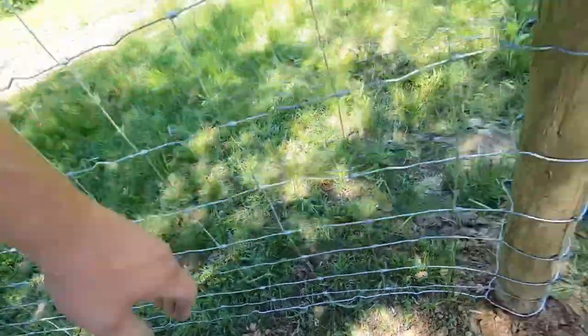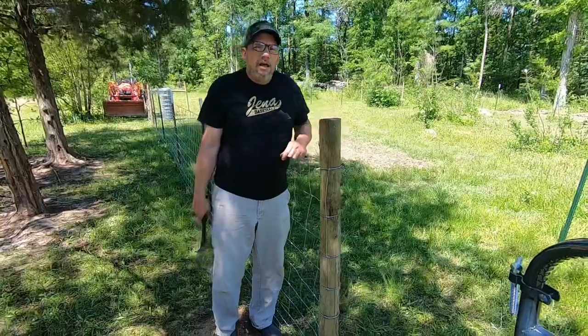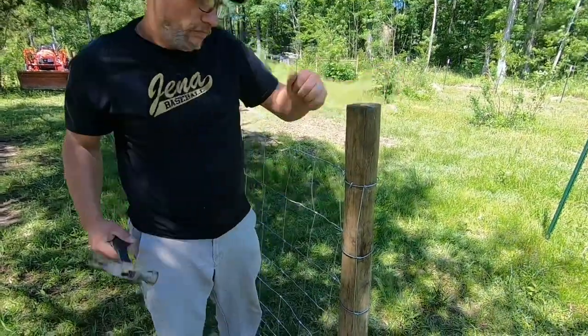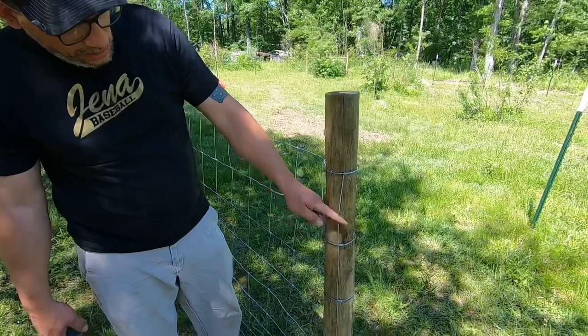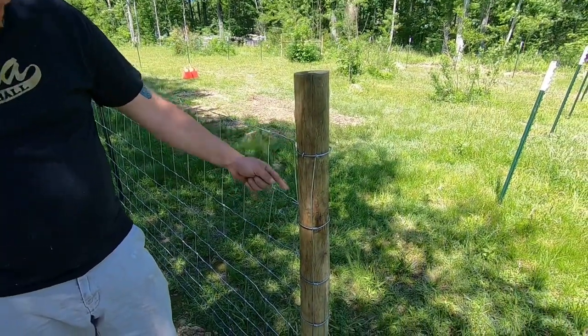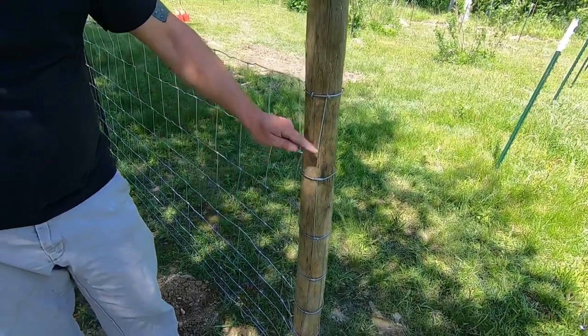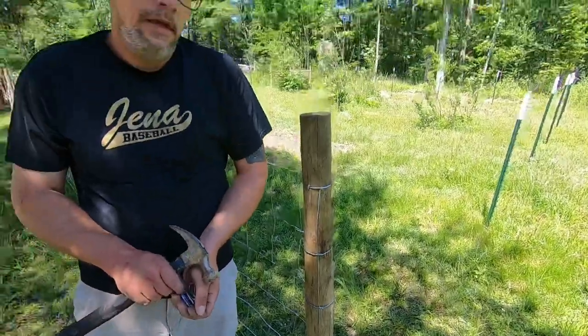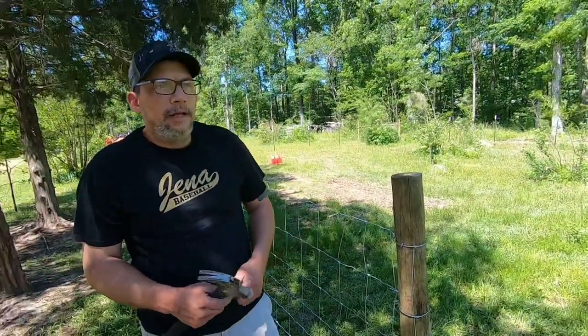Now them goats will push up against this fence. I probably should have used just woven wire instead of this hinge jointed, but it's going to be all right — good enough for goats, I believe. So we're going to staple this off. This is your main line and these horizontal wires are just wrapped around it at every one. This is what carries all the weight of the actual fence when an animal pushes against it. So we're going to staple every one of these all the way down on both ends, then cut it off and wrap that end, and this little section will be done.